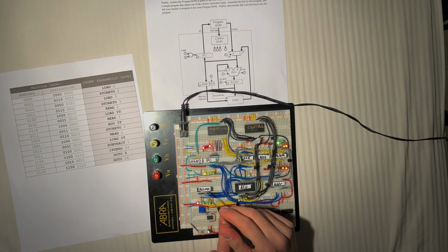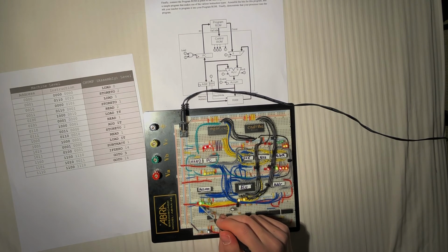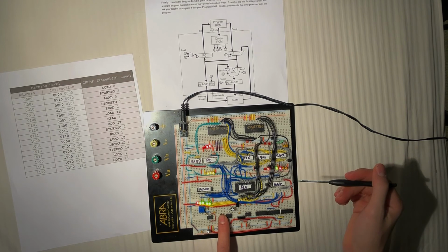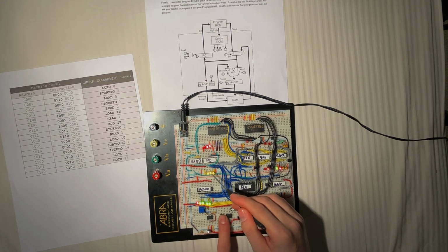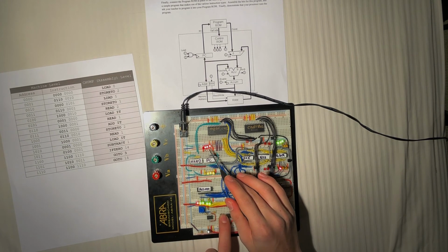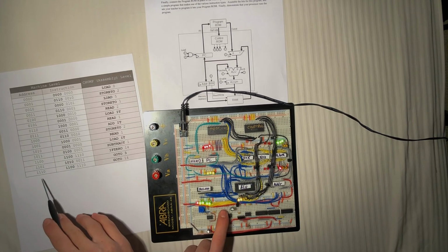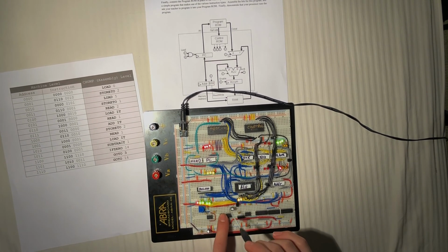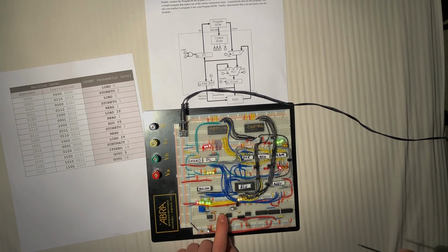We're going to read what's in address 1 and load it. It's a 1. We subtract 1. Check if it's 0. It's now a 0. So when it's 0, we should go to line 14. Line 14. And at line 14 is an infinite loop saying go to 14 at line 14. So no matter how many times I pulse the clock, my code will stay here.